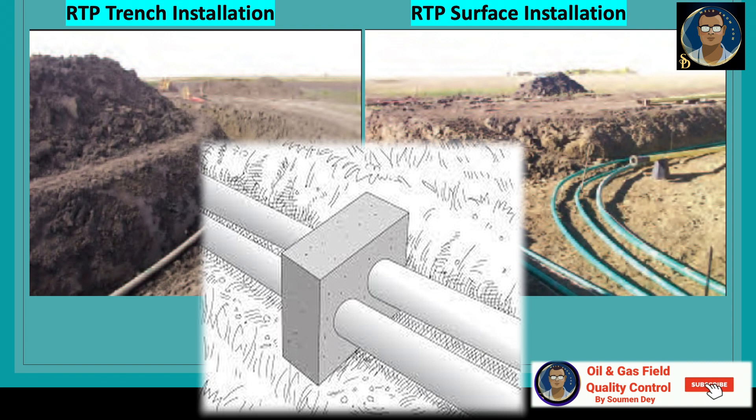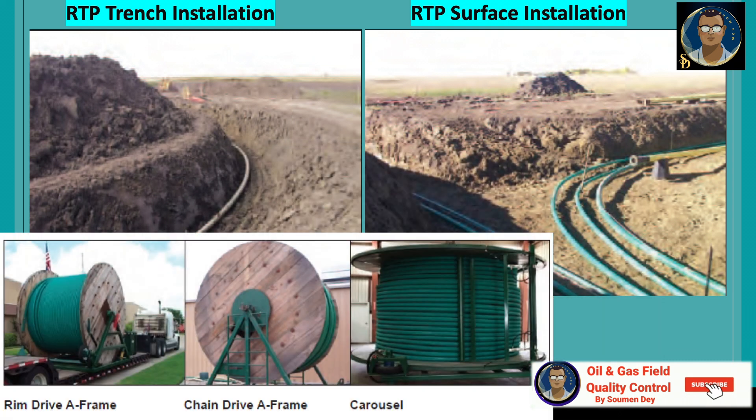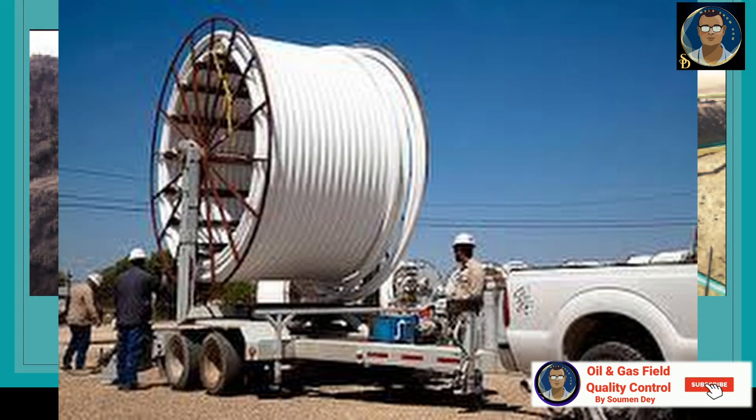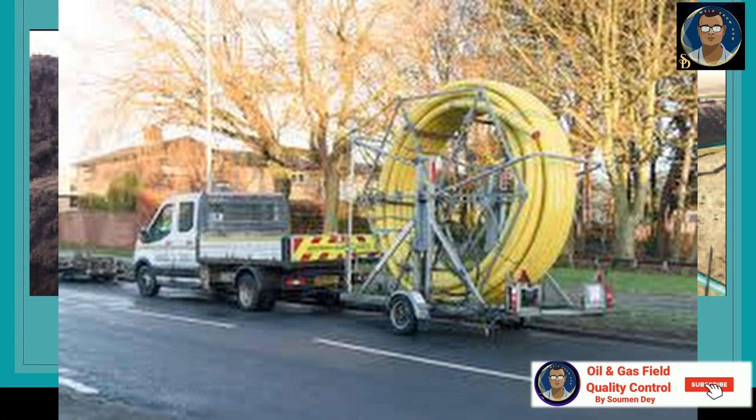This method of installation reduces abrasion damage to the pipe. It may involve moving a trailer with the spooling frame or spool and pipe mounted on it under off-road conditions. If access is too limited for a large truck, the pipe and spooling frame can be transferred to a trailer pulled by a pickup or tracked vehicle. Caution: this method should only be carried out where the access for the moving vehicle is flat and secure. The pipe spool represents a top-heavy load that could overturn. This should be performed only with experienced drivers and executed slowly with caution, as an overturning load can result in injury to personnel and damage to the equipment and the RTP.